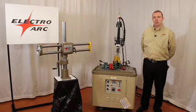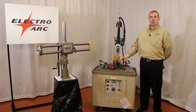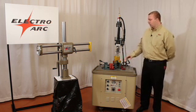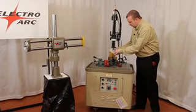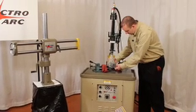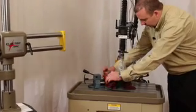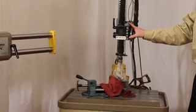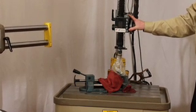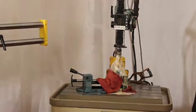To begin our disintegration process, we've taken the time to align our electrode over the top of our broken carbide tooling and to set our depth stop in advance. Now we go ahead and pull our splash bag down over our broken part, using rags to hold down the edges so that we don't get wet. Using the remote start stop switch, I can initialize our disintegrating process and let the servo head take over.